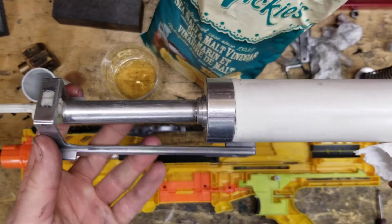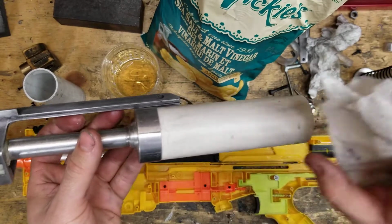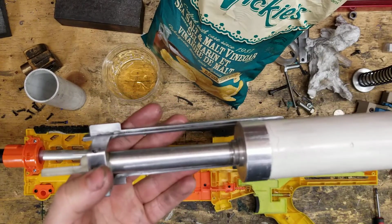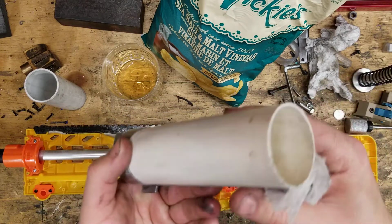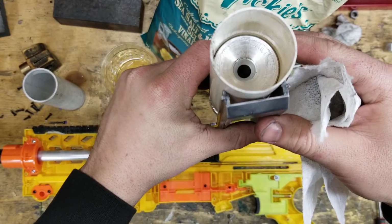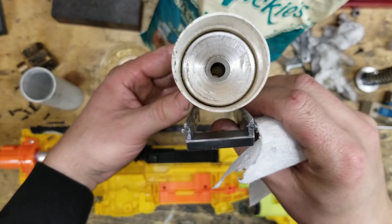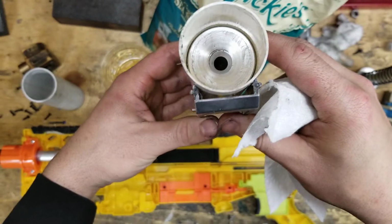Now here's the tube, aluminum end cap with the pump action shotgun tube. You have to cut it down just slightly. And then I have the Artifact sled. This used to be red, anodized red, but I just took a wire wheel to it and then I polished it up. But to use this sled with such a large tube, hopefully you can see what I've had to do. You have to bevel out the sides so the tube can ride in there.